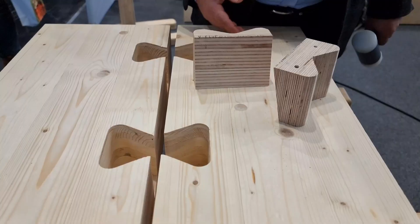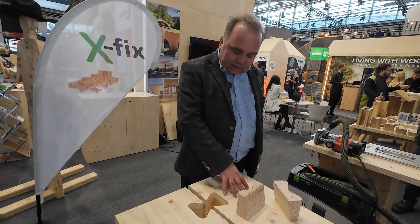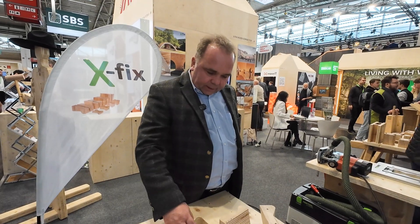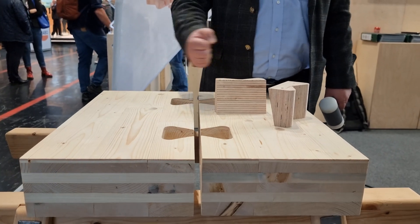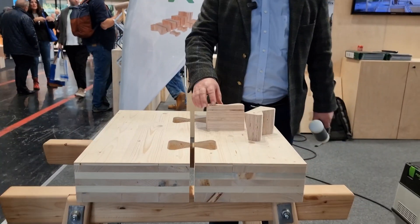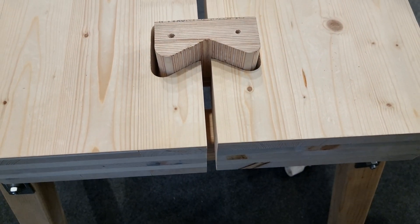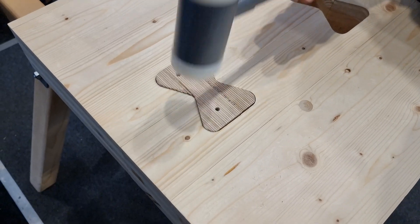When you have big sheets of CLT ceilings, one CLT plate stays on the building side and the crane lifts the other one near it. You always have a gap — normally you use wrenches to pull the CLT slabs together. With our X-Fix connector, you just put it in, the second piece falls in, and then you start hammering in the connection.